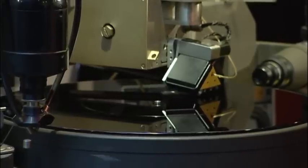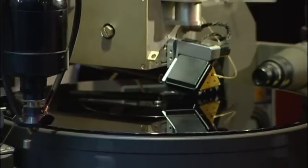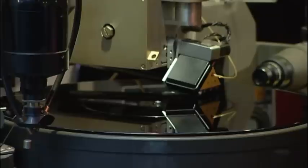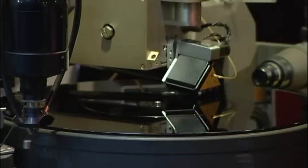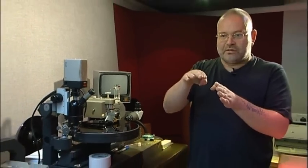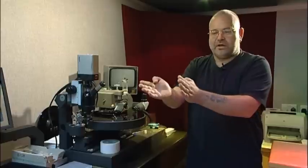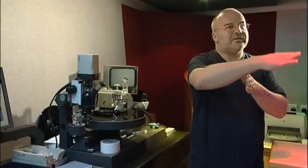There's the vocal. So basically what you've got there is a stylus and a couple of coils, and it's moving left and right and up and down, cutting the record. So for every movement left or right, up and down for phase. So volume and phase up and down. So you're having a groove that's not only swinging left and right, the base of it is going up and down as well. And that's it.